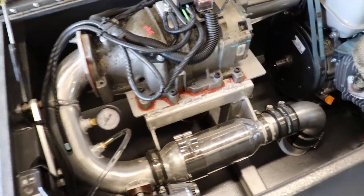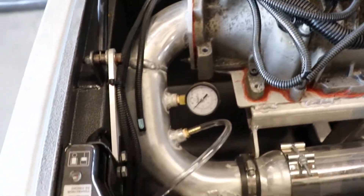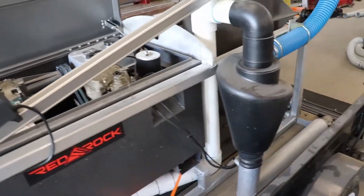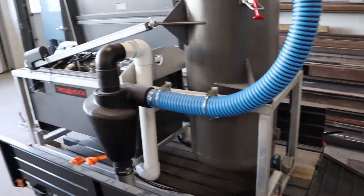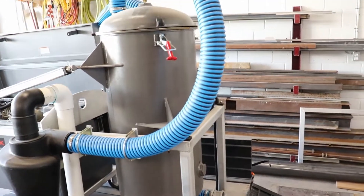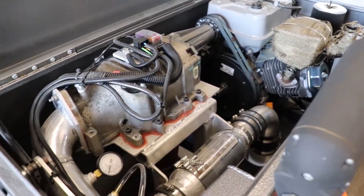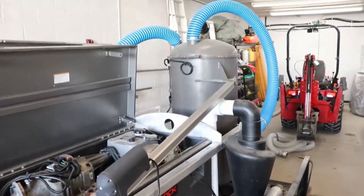Unfortunately we had to get to this point — the whole frame welded up, everything coupled together, motor bought, supercharger sacrificed — all of it hooked up before we could even verify the theory. We did run a test though. We were able to pull a 3 inch water column up about 9 feet. This was sitting on the back of the truck, pulling water off the ground. I think we built about 12 to 15 inches of mercury. We did it at idle because at the time we were having belt problems, and it seemed to do it just fine.